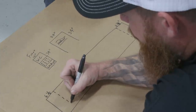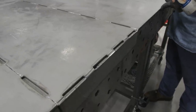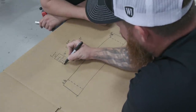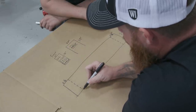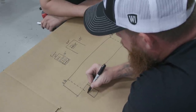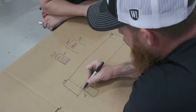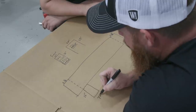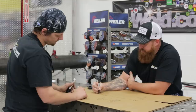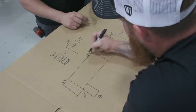We'll do some relief cuts — about quarter inch wide holes, probably three inches long with a radius on the ends — to take some of that metal away so when we bend it, it'll be a nice smooth bend since we're doing it all by hand. We want to get it all in one area and just do a bend right here. That was about seven and a quarter inches, so from here over that's gonna be twelve inches, because that's going to be the side — it's gonna be twelve inches wide. Then some relief cuts here, and we have our thirty-four inch height, going in thirty-four and an eighth from the center of the bend line to the center of the twelve inch area, which is gonna be the front of our machine.